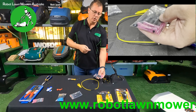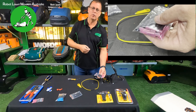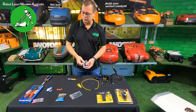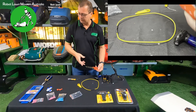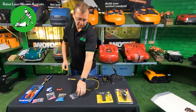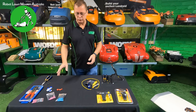The crimp joints with resin-filled heat shrink over the top - great joint, not a lot of tensile strength, but as long as you're just joining and burying it back in the ground, no problems whatsoever. You'll need the little crimpers to crimp those up. Then the solder joint, which is what we mostly recommend - that of course uses your resin-filled heat shrink, the wire stripper for stripping back the cable, the solder, and your little gas torch.